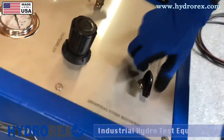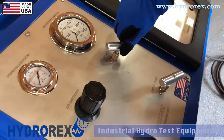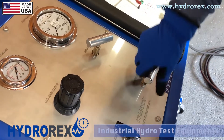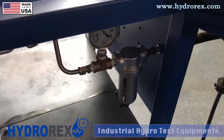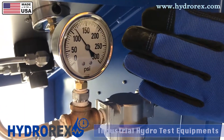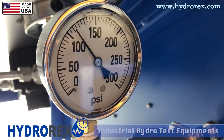Air supply: closed. Regulator: closed. Isolation valve: closed. Return and bleed valve: closed. Now we have the air supply connected. Always make sure that your gauge or your external supply supports at least 100 psi of air pressure.